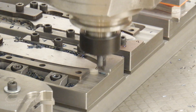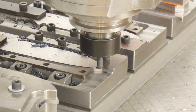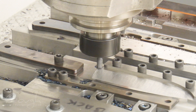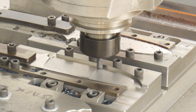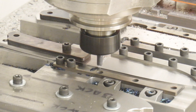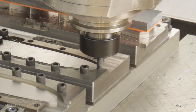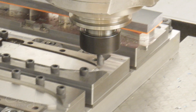The third station holds the profile blade so that one side of the bevel can be cut. First a roughing pass, and then a finer finishing pass. Special attention is paid to the plunge line to make sure that it's absolutely perfect. The process of rough and finish milling is then repeated for the other side of the blade bevel.